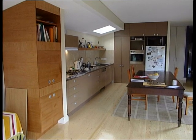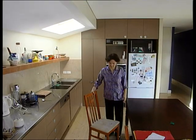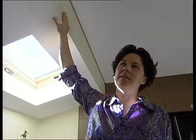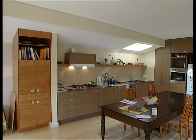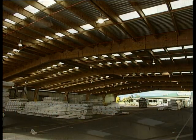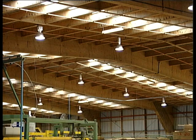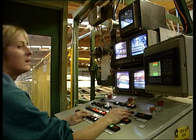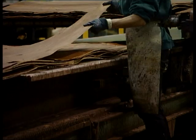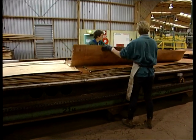This room is a very long space, so that walls and columns could be avoided and we could have a nice clear open space, we needed a beam made of a product that would take the span. This is plasterboard covering up the beam so you don't see it, but inside there is a very long beam of LVL. Laminated veneer lumber, or LVL, is like plywood but all the veneer runs the same way. LVL is made in very long lengths from standard pieces of veneer that are laid overlapping each other like tiles on a roof, with the top scarfed to produce a smooth surface with a strong joint.